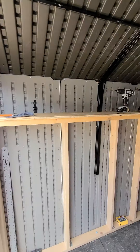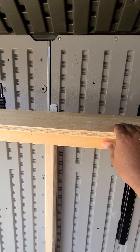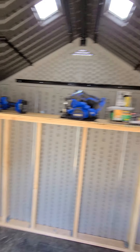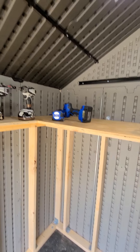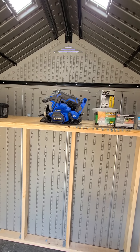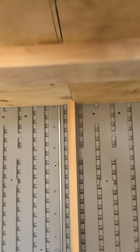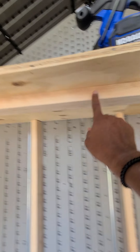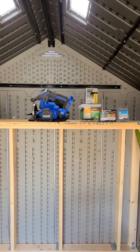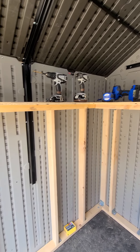The shelves aren't super wide but they're wide enough. The back shelf is about 22 inches wide, and the side shelves are 11 inches wide. I cut the side shelves shorter to accommodate the back piece. That back piece is the full width of the entire shed, so I had to cut it in half down the middle and join the two halves on a stud, which gave me support to screw both pieces in along with the cross-support piece. I don't see this going anywhere — I have more than enough studs supporting the shelving.